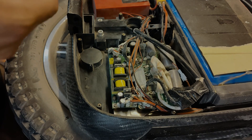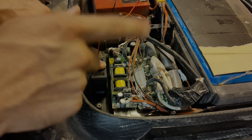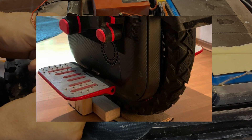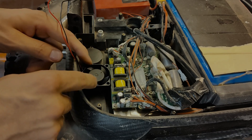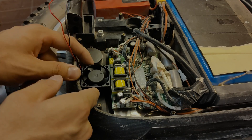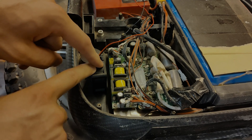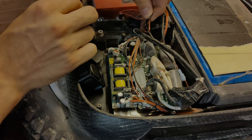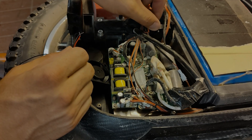You've got two options if you do it at home. You can place it here so you have two fans blowing on the board, or you can turn it around like a friend of mine did — he drilled some holes into his cover and blew the air out. I think that's also a nice idea. I will go with just placing it here for now with some hot glue and solder these two wires onto the connection I did over here. This fan worked quite well.